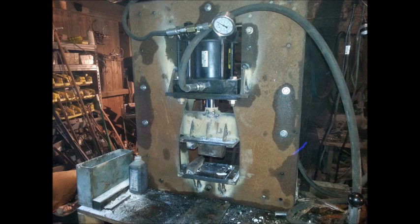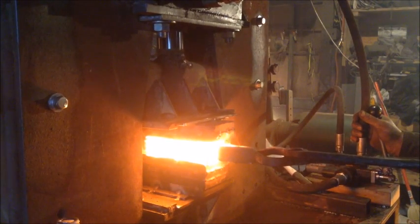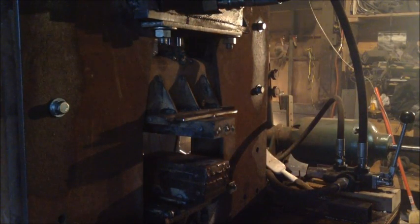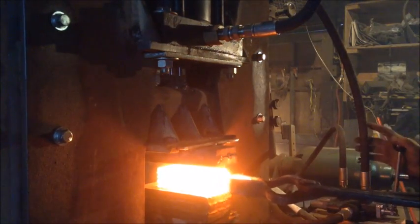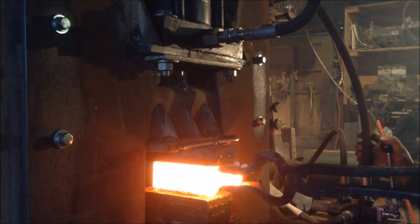Here's the design I came up with: it's 32 inches tall, 26 inches wide, and about 4 inches thick, and it puts out 30 tons of pressure. Here I am welding a billet of 5160 and 15N20, using the flat dies. These flat dies are about six and three-quarter inches by three inches wide. This is just about the maximum amount of surface area that can be used effectively under a press this size. The next set I build will definitely be a little bit smaller, and should be able to put out a little bit more force where I need it.